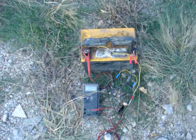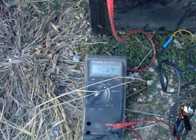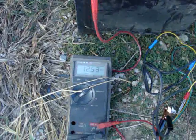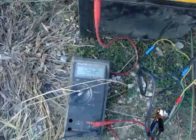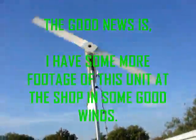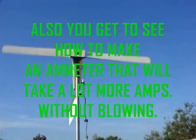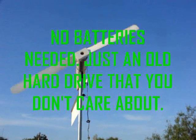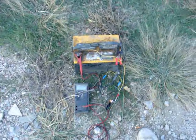When the RPMs get above the 12.51 on the meter, watch it — 12.59, 12.6. You see it's kind of dancing around, then the blades slow back down. It looks like it's staying steady at 12.53 — you're putting two-tenths of a volt into the battery on a charge, so it did pretty good. Unfortunately I blew the fuse on the amp meter and don't have another one, so we're not going to see any amperage. She's down about 5 or 6 volts worth of RPM, but it's still cutting the wind real good and the lift is taking over. This will stay spinning all the way down to about 4 or 5 miles per hour. Once it gets above the battery voltage, it gets a little bit of drag.